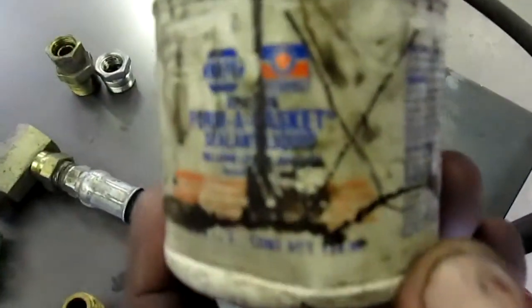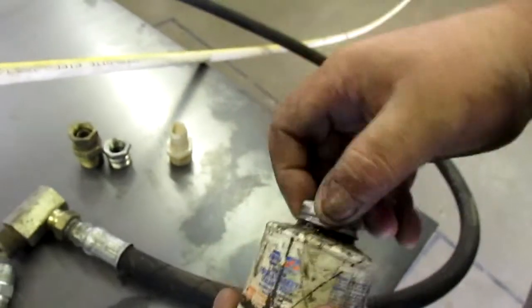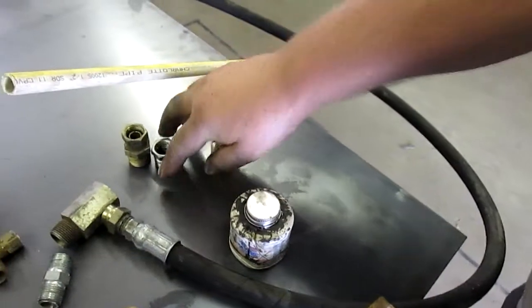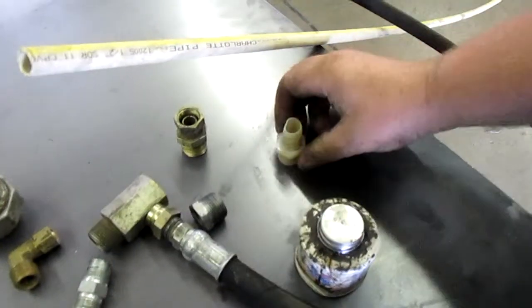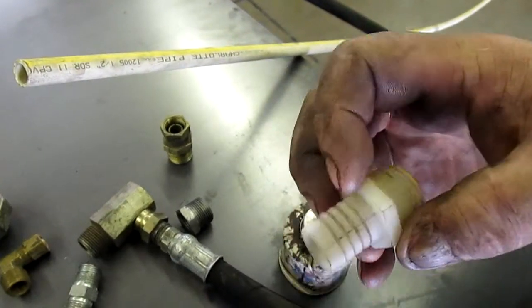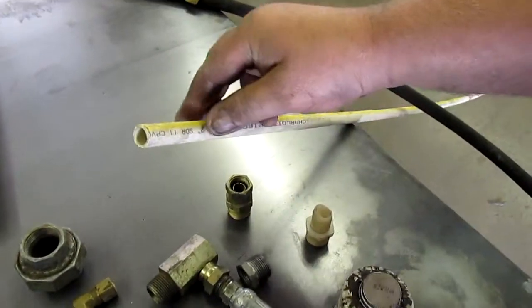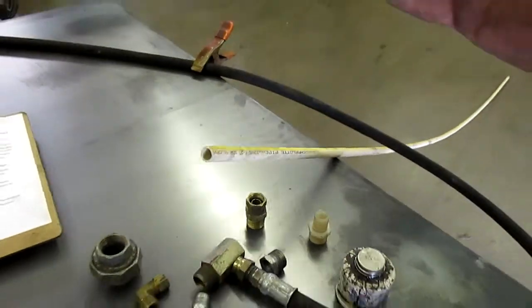Use Permatex on all your fittings — regular Napa, aviation, or Indian Head shellac Permatex works great. Teflon tape will suck air. Use good quality fittings. Don't use plastic fittings — a hose clamp will smash them flat and they'll suck air. Many hoses are not oil-proof. Don't use CPVC for the suction line; that causes problems. We recommend seamless half-inch flare copper line all the way from the meter pump suction filter to near the bottom of the tank, a minimum of eight inches up from the bottom.